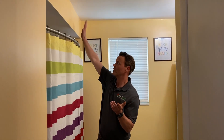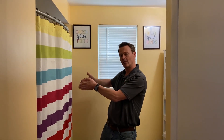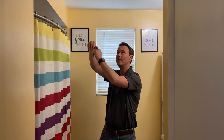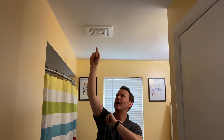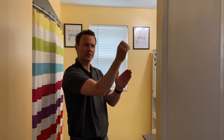This is just a normal bathroom in a house that was built in the late 60s. To my right, above the shower, I've got what we call a bulkhead or drop ceiling — this is going to have a series of stud bays all around it that are open into the attic space, just allowing warm air from the home to gush upward into the attic year-round. This has to be capped. There's also a bathroom fan that will have gaps around it, switches where wires go up creating holes that need sealing, and all of these walls have top plates on all sides that also need to be sealed.